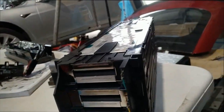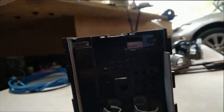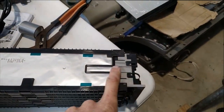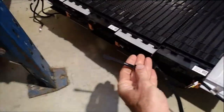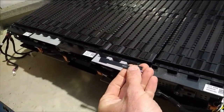You've also got — there it is — half of the BMS sense leads come out this end. The other half come out at the other end. And then up here you've got this slot for almost like a knife thermometer — thermocouple, thermistor — a thing for measuring temperature. So that's what the temperature measuring device is on these modules.